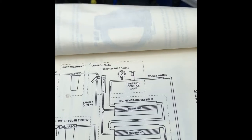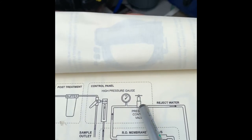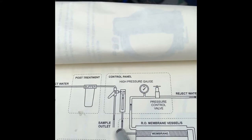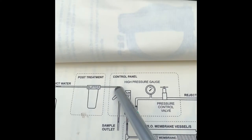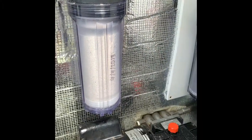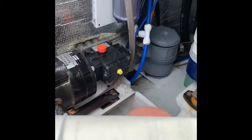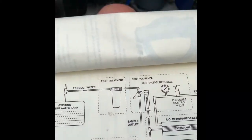So the flow is: high pressure pump, through the membrane, then to the gauge in the bedroom where back pressure is set to 800 PSI, then it goes to waste. You have the flow indicator, and when you switch it over via the blue pipe, the water goes to the post-treatment filter. I made a little date indication for when we change the filter. From there the water goes into the holding tank — that's the full flow of the system.